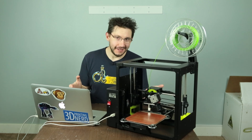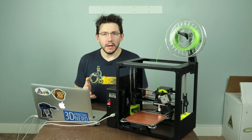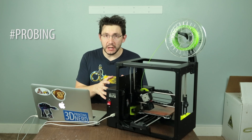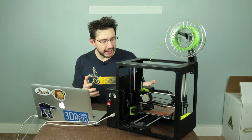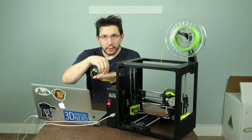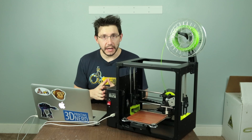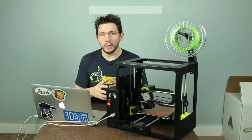Any of the other printers I own, I would be afraid of the nozzle and the whole extruder carriage rubbing on it like that because it would destroy things or make things catch on fire. But the way this printer is engineered, it's built to do that. Once it's done with that, it actually levels the build plate. There are four metal discs in each of the corners of the build plate, and the hexagon hot end is conductive, so it touches down on each disc, gets the height of that corner, and knows the level of the bed — then it can print a fantastic first layer.